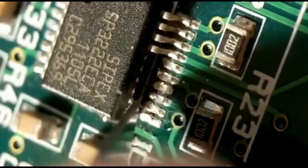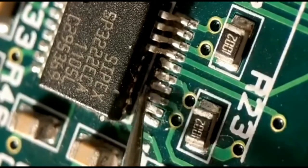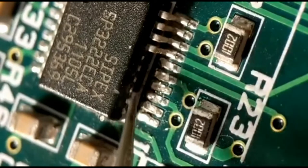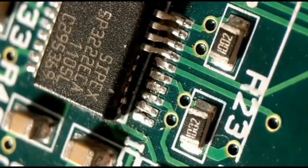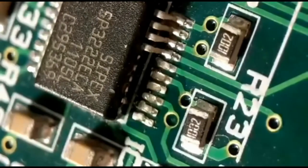There we go — you've now got six little bits of copper exposed. I'm going to wick off all the excess solder on the pads and then give it a clean up, giving you a basis for a rebuild. I'm putting a little bit of flux on the pads and then gently wicking off the remains of the solder.